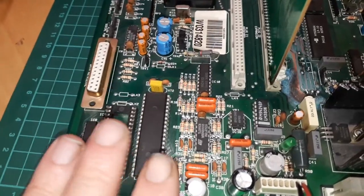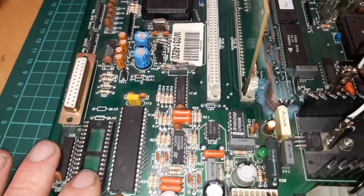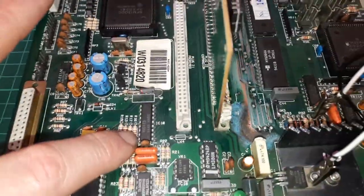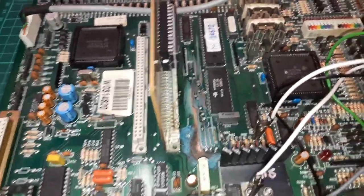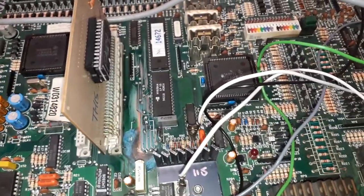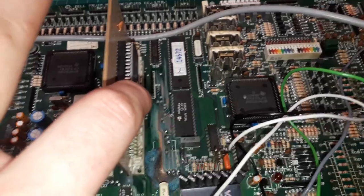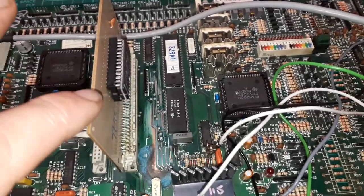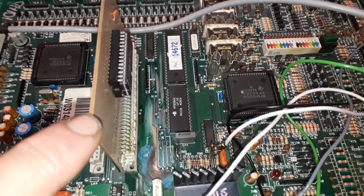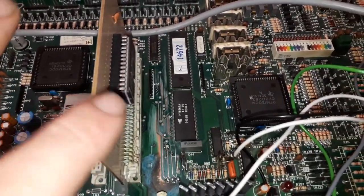This, by the way, is your digital sound circuit. No ROM in it, and at the minute it doesn't matter, because we don't get far enough to test digital sound. Any sound you hear in this video is coming out of the little Yamaha chip there, which the machine uses to send the alarm signal. Anyway, I was saying, people buzz out from there to here. They forget something though. There is a thing with Scorpion 2 that you don't see on other systems. This ROM here, by the way, ignore that bent pin there, this ROM works.